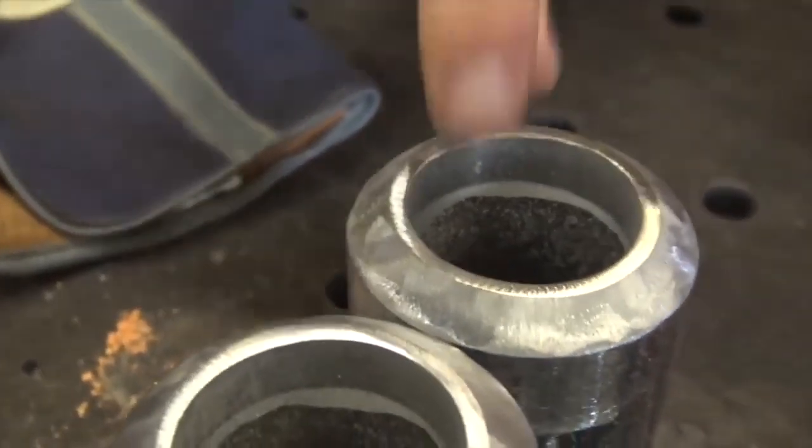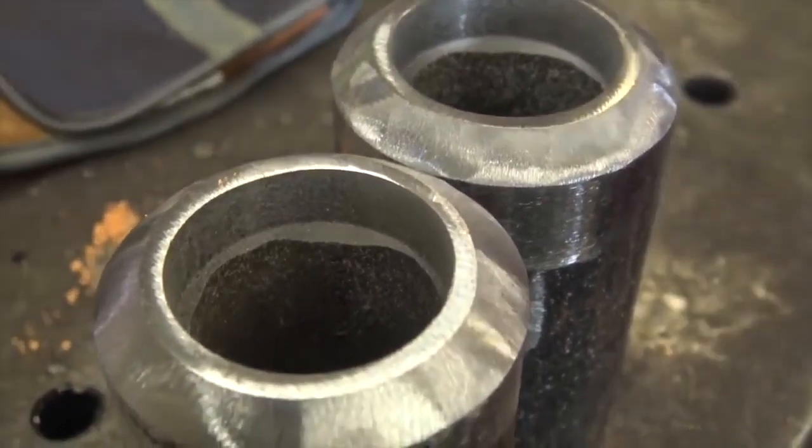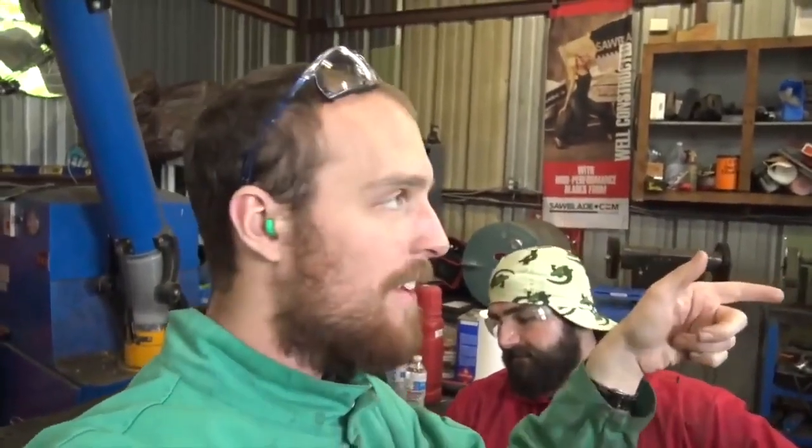Make sure that you take any burrs off — anything that's going to come between your weld and tying into the base metal. For those who haven't learned this about pipe welding: difficulty is more or less synonymous with diameter. A 40-inch pipe, the angle's not changing very quickly. By the time you put four tacks in this and feather it down, you're talking under an inch to weld per section and you're moving fast.